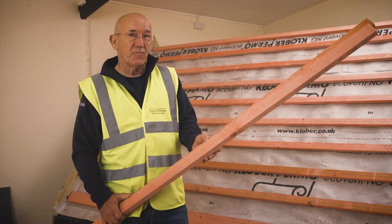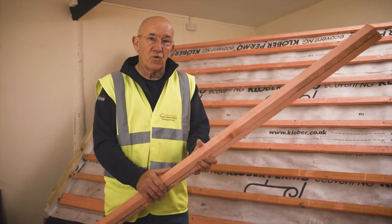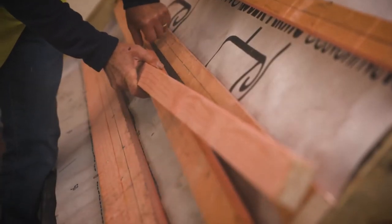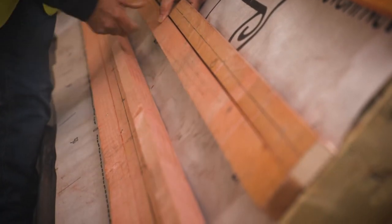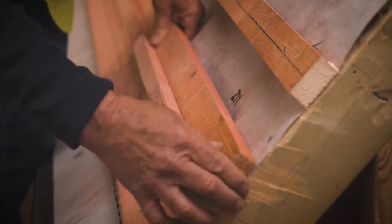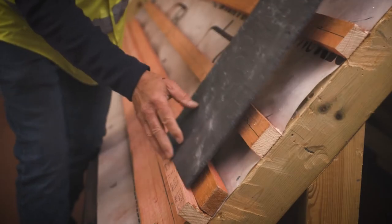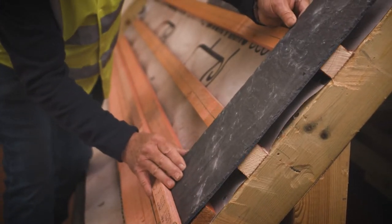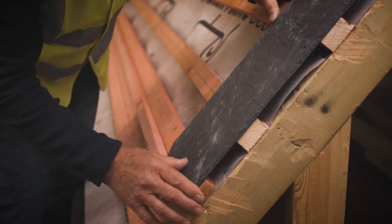I'll show you the perp ends in the simplest way possible. I've got two pieces of batten and all they're going to do is help me to put the slates on the roof without falling down. The bottom one goes like that, the top one goes there. This is the one I'm going to mark my slate places on, so that needs to be flush with the end. I'm now going to get my slates — they're going to sit square onto that one, and that one stops them sliding down the roof. I want the slate flush with the end.